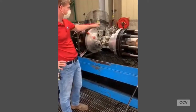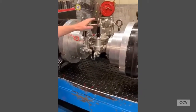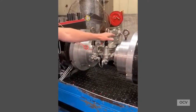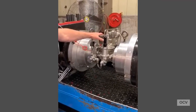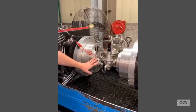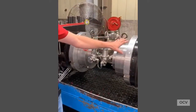So here we've got our 127-5 BMD. It's got quite a bit on it, but it's a lot of extra features to protect the downstream system where we're feeding fuel into the aircraft wing. We've got a differential control that basically keeps our main valve — our 2-inch valve — primed so that we have quick closure when we need to. It's got an electric dead man that operates an accelerator pilot, and that accelerator pilot also helps the main valve react and close extremely quickly to prevent overpressuring the downstream system.